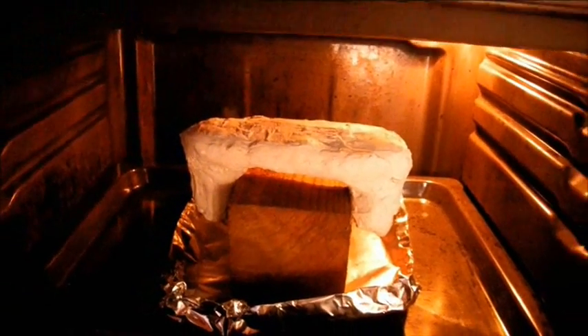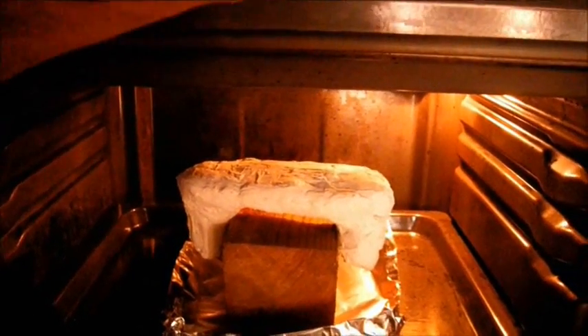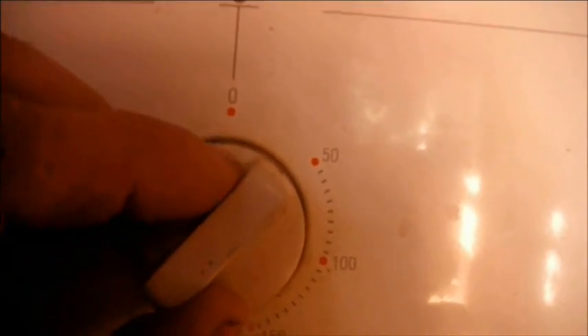With the investment thoroughly dry it's time to remove the wax. I do this while my wife's out and I tend to close all the internal doors as the smell really is quite pervasive. In fact, to minimize the smell I get the wax out at the lowest possible temperature, and I rescue it from the oven before I max the oven out for several hours to drive out moisture from the plaster.